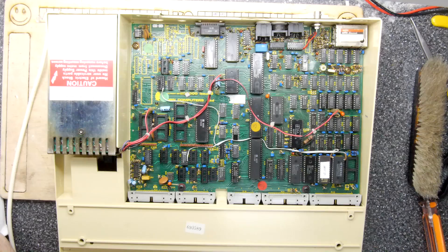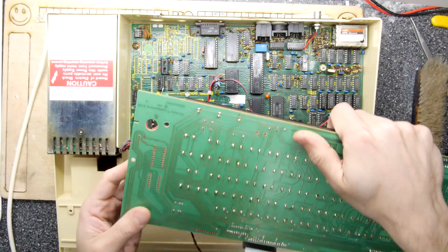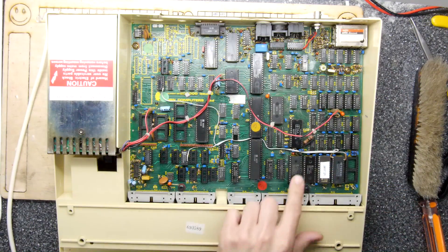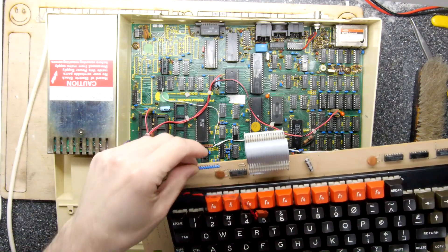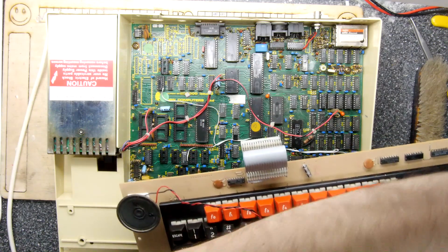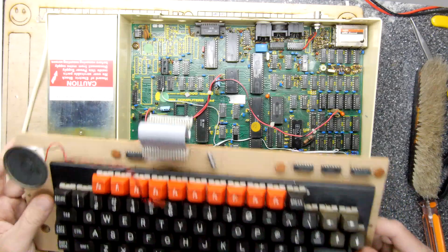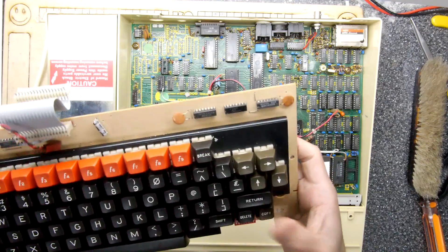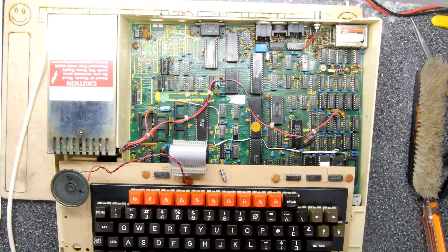On the keyboard, there's always been that slot underneath the removable bit, and I believe that's to do with another RAM expansion. Looking at it, they haven't attached the header, so with a bit of soldering you could just pop in a pin header and get a ribbon connector going — it clearly lines up with the one on the board, so that could be a nice little mod. Not sure what these DIP settings are from the bottom of the keyboard. That is a big old industrial keyboard — you'd have a hard time breaking that one. Going to pack it all back and deal with it another time. Thank you for watching.